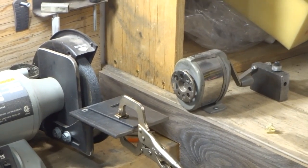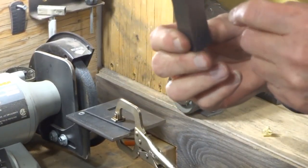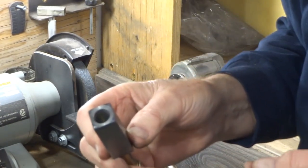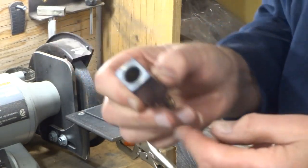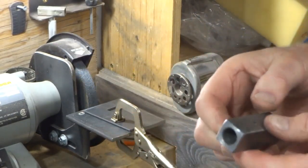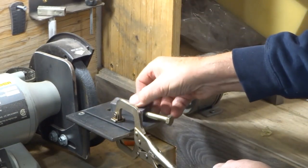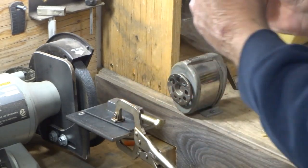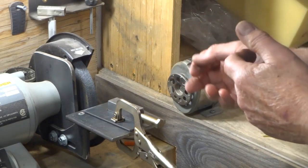This is only good for half-inch end mills. You'd need another block with three-eighths holes for three-eighths end mill shafts. And if you have a four-fluted end mill, instead of turning it 180 degrees, you'd turn it 90 degrees at a time for all four flutes. It does give you some regulation over your depth of cut because you have the screw to adjust it.